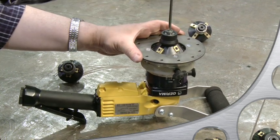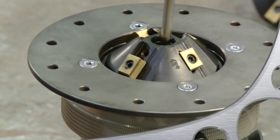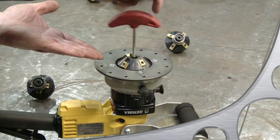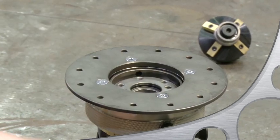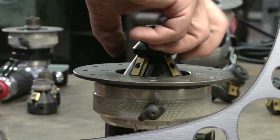Once it's off, loosen the milling head with the same wrench. You'll notice that it's pressed out slightly so that you can pull it out easily. If it's stuck, twist in the guide wheel one or two turns and use it to pull out the milling head.